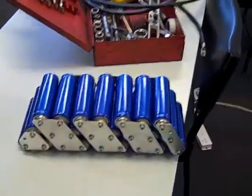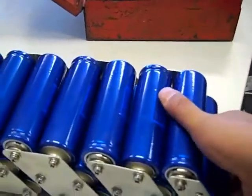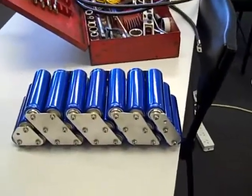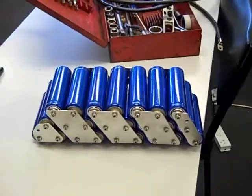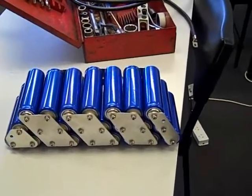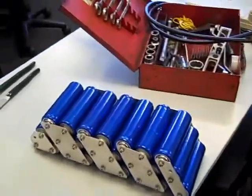What we have here is the battery pack. We've designed it so that when they expand, they can move - they've got a bit of a concertina effect. They'll be sitting with some rubber stays inside their enclosure so that the rubber can expand and allow it to move, but it won't go bashing around as we go through corners.